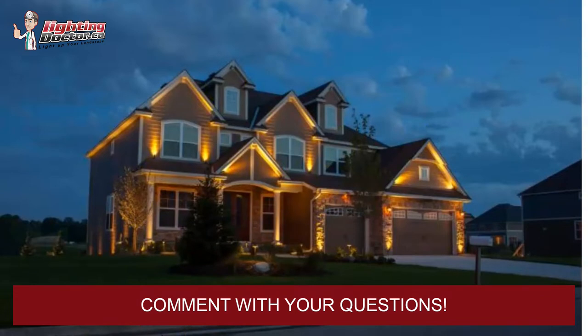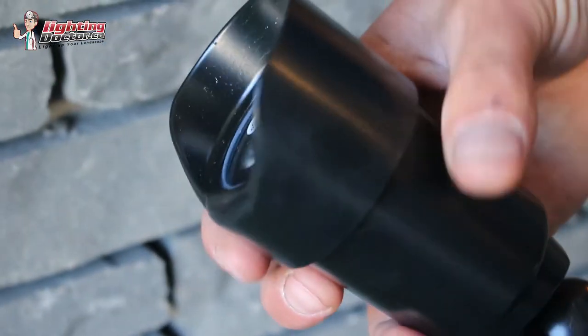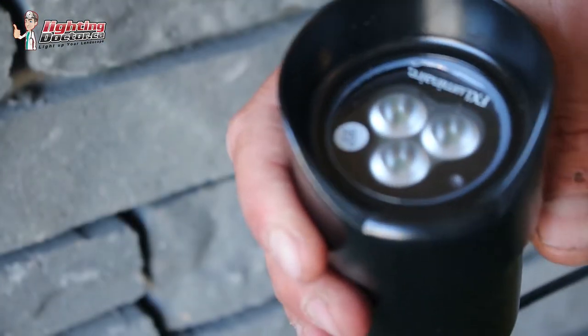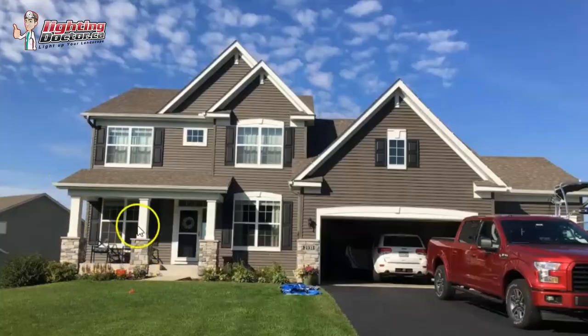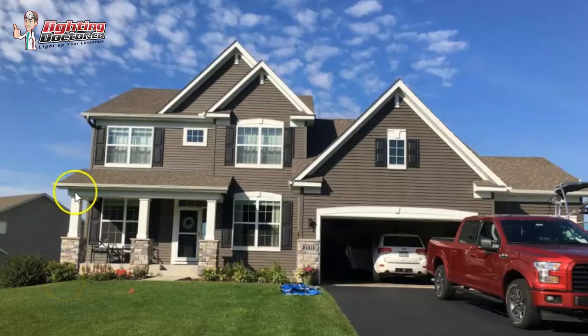This is a good visual of what I think you could get your house to look like. What I would do is start with some up lights in a couple different areas, mainly on the columns you have across the front. I would have four of those just behind where you have the bricks. The real key is you don't want to bring them too far back — just 12 to 18 inches back — having them shine more upright so they get the nice stonework as well as the columns. That light hits the top here and almost lights the whole archway, giving a little reflective light back down into the bed.